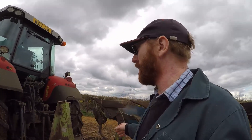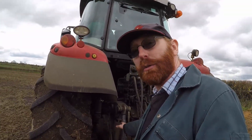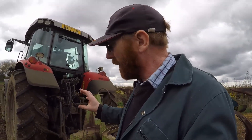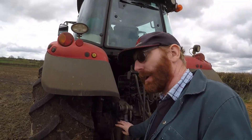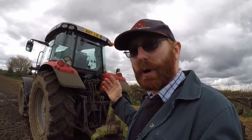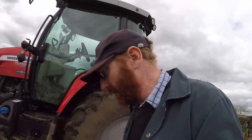So there's a few things we need to do to the tractor before we hitch on - obviously we did it back in the yard. For a reversible plough we need to make sure the two lift rods on each side are identical length, your tyre pressures need to be equal and not too high - you want to be a little bit lower on pressure, not rock hard like you would for road work. It's most important to keep the two lift rods and the two tyres level, everything's got to be matching both sides. Because we're spinning the plough side to side, if one is longer or higher pressure than the other it can put you out of balance and you won't get level ploughing. So that's all done in the yard - do that for your hitch on because it's easy.